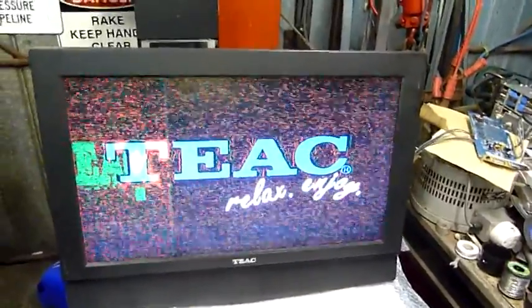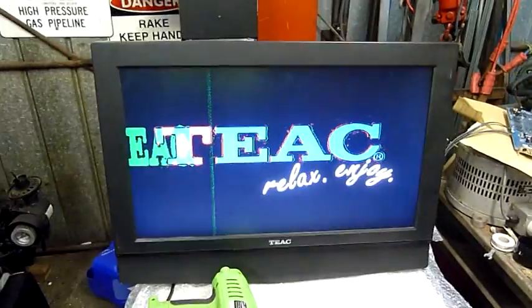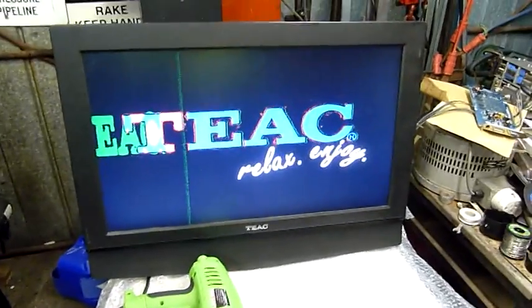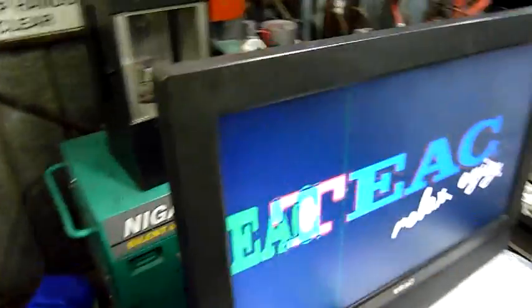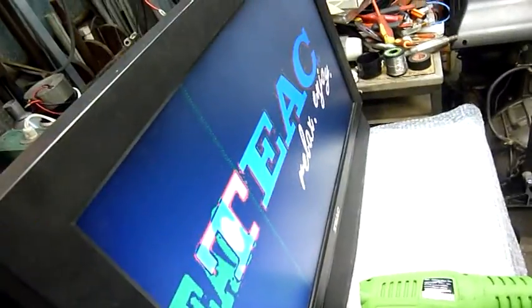I don't have anything that runs HDMI as far as I know. Well, that was interesting — I was using a PC input to do the heat test, and now that I've just hit the processor side of the board with the heat gun, that snow just faded away. The problem isn't gone but the snow is gone and the vertical scrolling lines are gone. I was hitting the chip with the heatsink on it, which I believe is the main processor. As soon as I heated this region up the fuzz just dithered out and went away.